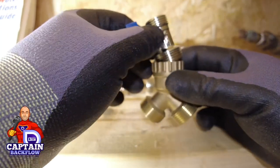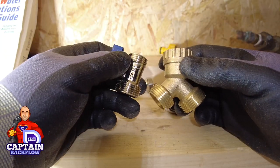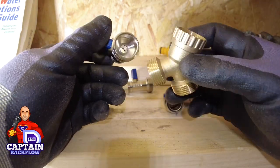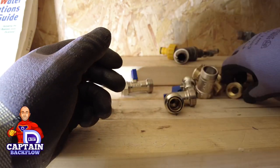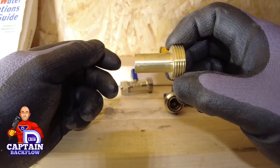Here's a little tip: some jobs have a plastic splitter fitted, and the plastic has gone brittle and is causing flooding. If you come across a plastic version, take it out and put in the brass version instead.